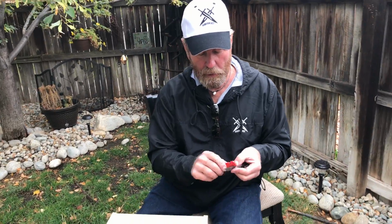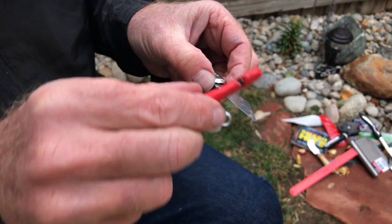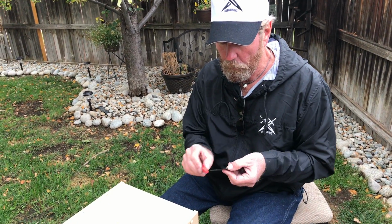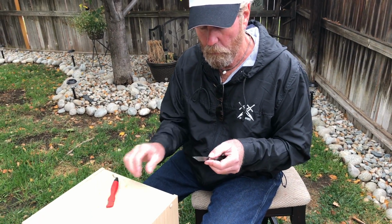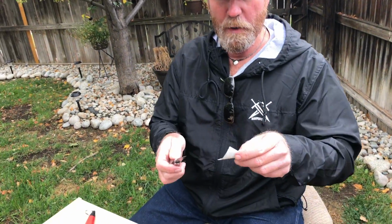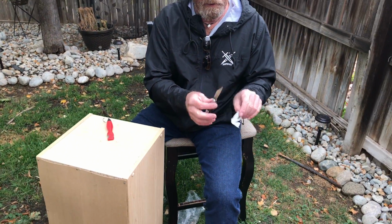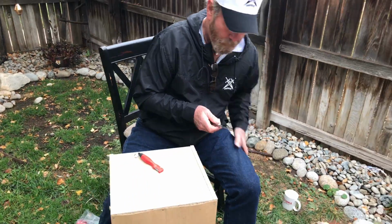All right, let's see. I can still see it's a little thick, so I'm just going to hurry, just like that. When I tip it back and forth, I can actually see a little glisten of a shine on the cutting edge, and that means that there's still a slight flat to it, just in places. All right, let's see. That's starting to bite. This is really thin paper. I've said that a million times, but you've got to have a crazy sharp knife, and that one's actually pretty sharp for the way that paper's floating around in the air and it bends and it's light. Let's see if we can make it just a little bit sharper.